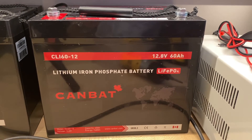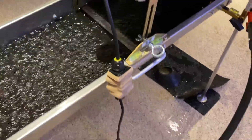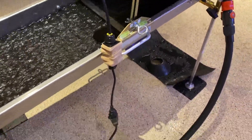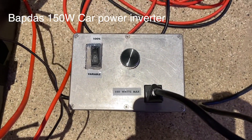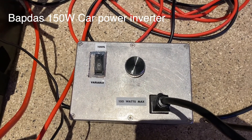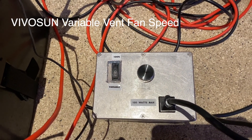I'm using a 40-watt concrete vibrator. I adjusted the length of the cord to make it more portable, but because it works on 110 volts I had to put a converter from 12 volts to 110 volts inside a project box, along with a fan speed controller inside the box to adjust the vibration level.